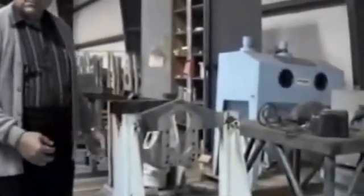From then on, it goes into the aircraft. Here's the assembly fixture, the final assembly fixture. This is what you put a fuselage in? The whole fuselage locates on its aft end, and then you locate this jig and drill the attach holes for the horizontal stabilizer, which is bonded at a vertical angle to that particular area.